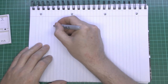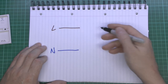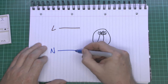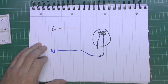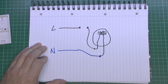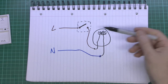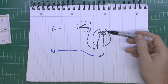Now in the simplest possible circuit, we're going to have the line coming in. And of course we're also going to have a neutral connection. And then we're going to have some kind of lamp — just drawn here as some old-type filament variety. And then of course the wires will come out of the bottom like that. In most circuits, certainly in the UK, it's only single-pole switching, so the neutral is not switched — that's permanently connected to the lamp at all times. And the line is the one that is switched. Essentially all we're doing is putting a break in that wire, and then the switch is in here with the movable contact. So in the open or off position, it's not going to light up because there's no path for the current to flow. But when you turn the switch on, it basically just connects across, completing the circuit — so the power will flow and the light will turn on.